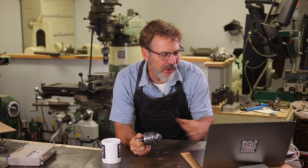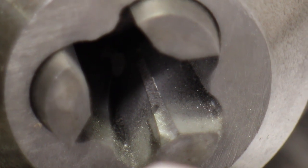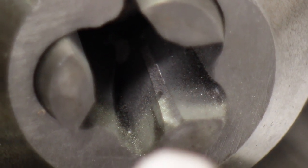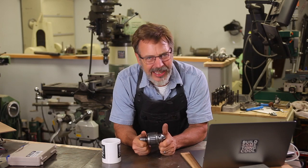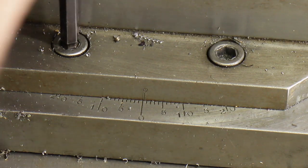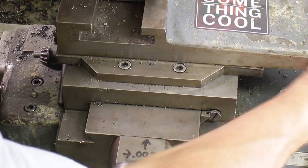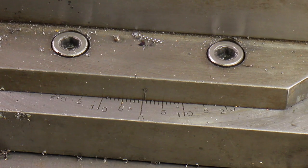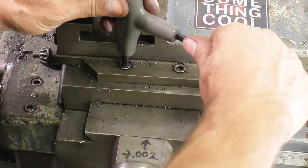Look at that. If we look inside there, we have a little problem — you'll see it tapers. At the toe of the jaw you can see it's a little wider than it is at the back. So I was trying to figure out how to fix this. What I ended up doing was changing my compound — I just took a guess on this and decided to set the compound at about 1 degree and ground it in that way.